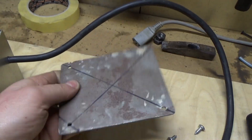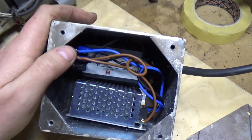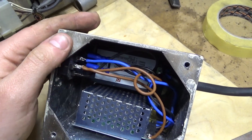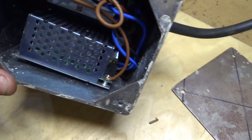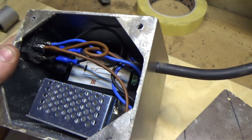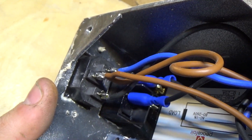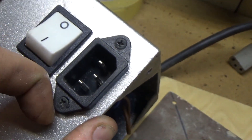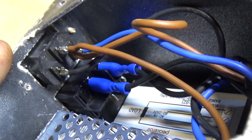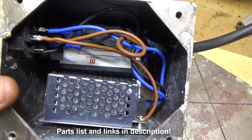As you can see, this is just ordinary steel plate - not too thick, but not too thin, so you can't really bend it. You can see how I welded these corners. These are pretty rough, but you can't see them, so that is fine. It is not painted on the inside. You can see here how I made the hole for the PC power supply connector and I screwed it on the case with some screws from this side. I mounted the switch and put some connectors to it and it is all hooked up inside this box.